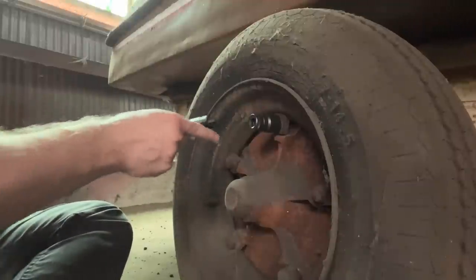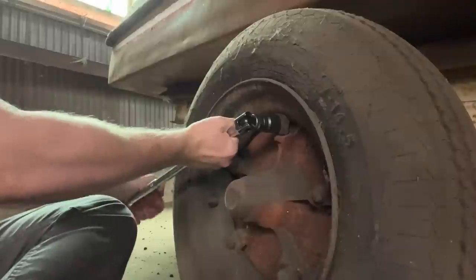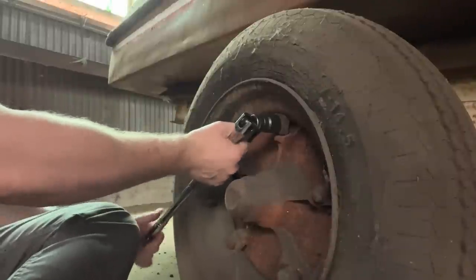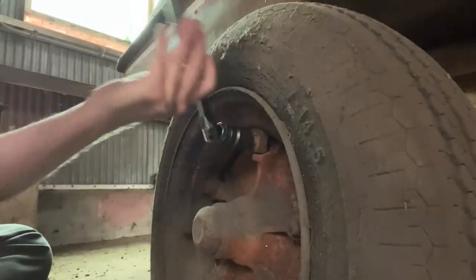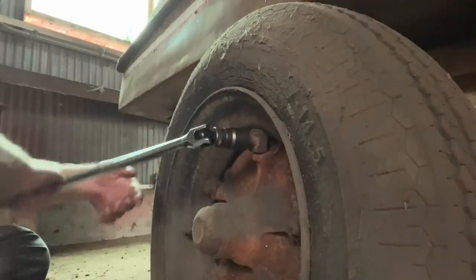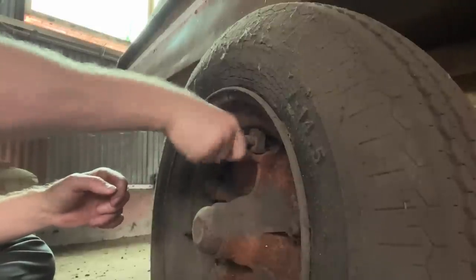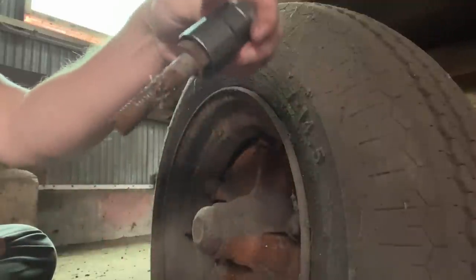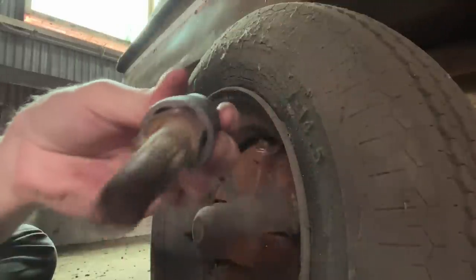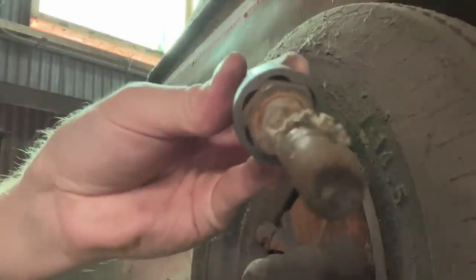What you're trying to do is prevent shearing the bolt off, but this one's moving. I'm not even going to take the bit off or put a different socket on — I'm just going to keep working it with gentle leverage. At this point it's just freely turning, not fighting me much, so I don't need nearly as strong an angle. Bolt's coming out — and you can see how tightly gripped the extractor is, and how those scallop shapes really bit in on the counter turn.